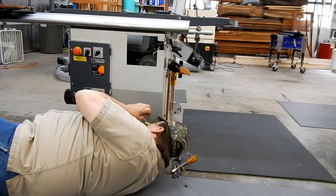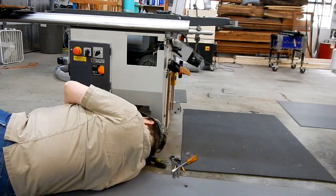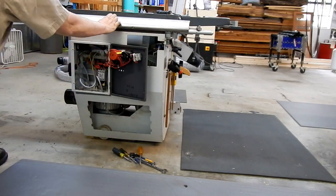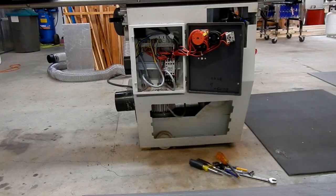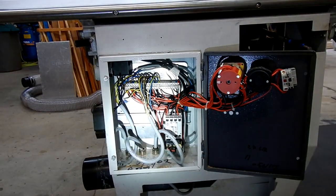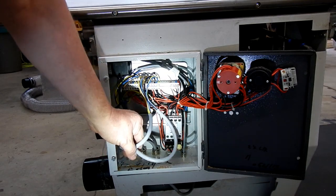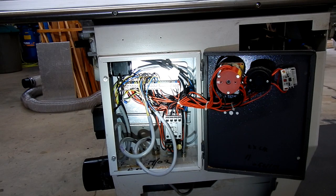We've got the tools off of there. Unfortunately, you've got to take some of this wiring loose too. The saw motor and the shaper motor are both coming out with it, so you've got to pull this wiring disconnected and pull it out of the box. I've got everything color coded to the color of the wires, and I actually made a wiring diagram of it too. Here's the box — this wire here is the saw, and this wire here is the shaper. The joiner's over here and it doesn't have to come out. So these two wires have to be disconnected and pulled out of the box so that the motors and everything can come out of the saw cabinet.